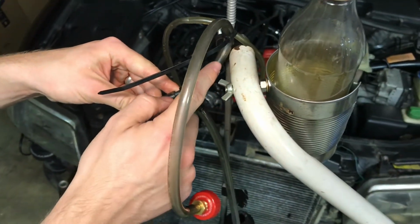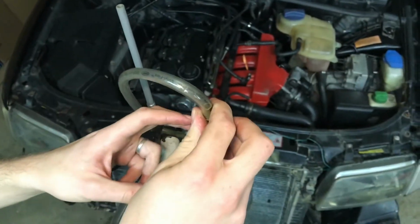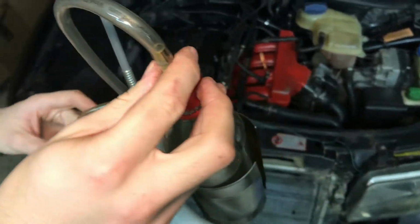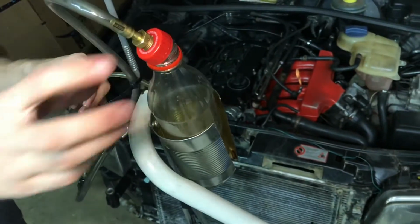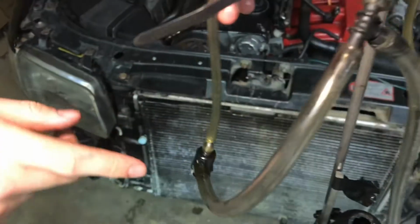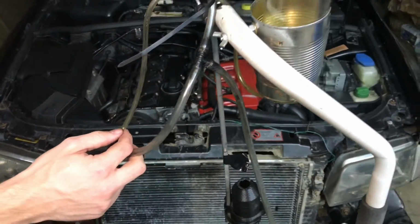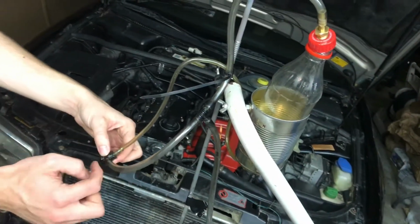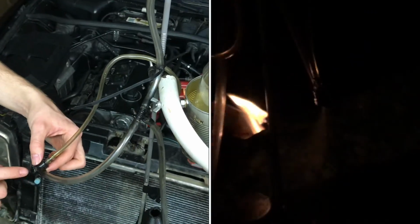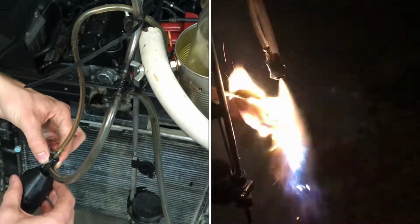And this other half, you can see, comes around to the top of the bottle. This is filled with the kerosene and comes out the bottom. The air will push the kerosene down through into the atomizer. So really we have the single air source that goes straight in and presses the kerosene into it. And that same pressure source feeds both propellants right here into the atomizer and then of course into the chamber.